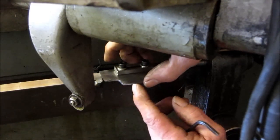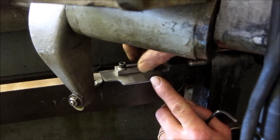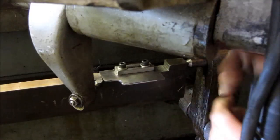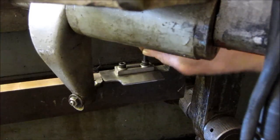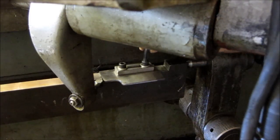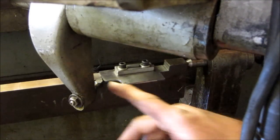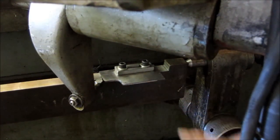The slots we put in there worked out fine and we're just touching that up to our stylus, because our stylus is in position where our cutter is up there. We're just going to tighten this down right here, and we hope it's just a one-time set with all our dimensions figured out and programmed in. This should be able to come out and give a nice radius — a female radius here, a radius out to the outside diameter.